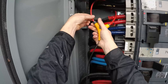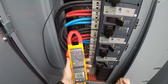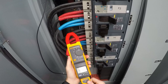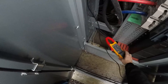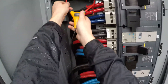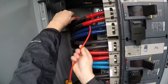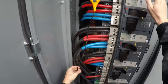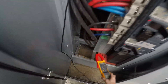So let's wrap this around both of the wires. That's A — now it shows me that there is 576 amps loaded on A. That's good, that's less than 600. Even if it goes up to like 610 it's fine, nothing's going to happen.